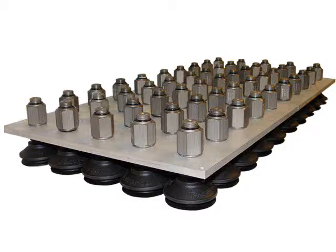In this particular application, various stamped steel parts are being handled by a manual lifter. If a vacuum cup is placed over a hole in the stamped part, the self-closing valve will isolate that cup from the rest of the system. This will ensure that full vacuum is maintained in the rest of the squid head.